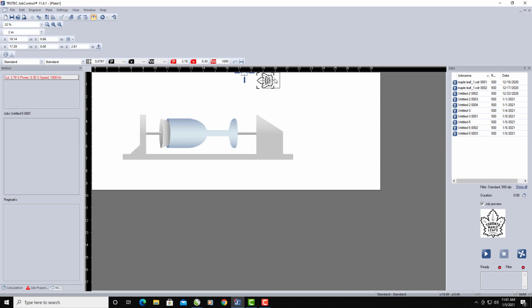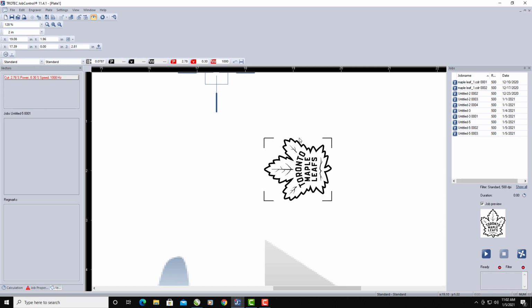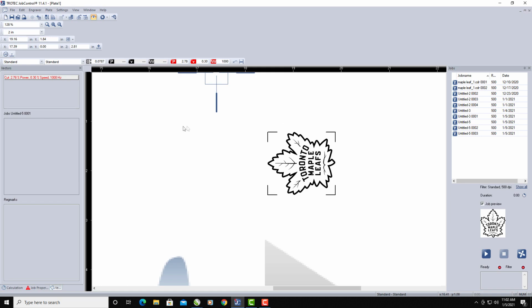So really all you're doing here is establishing where I need to be left to right. And for most applications, I normally like to be at the top of the page because what I want to have happen is the etching has to happen right away. Okay, if I bring it down here, then I've got some turn, and you've got to be careful to measure whatever that turn is supposed to be. There's ways of doing that, and we'll show you how, because sometimes I do bring it away from the actual edge, depending on the location of the actual logo.